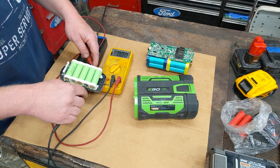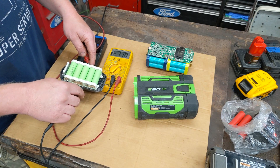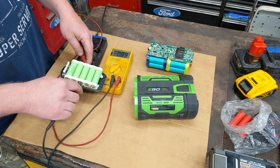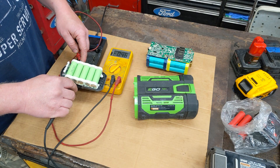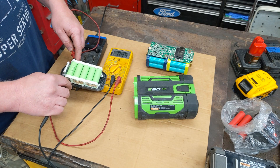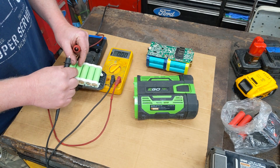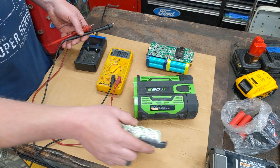The second cell is 1.1 — that will probably come back. About 0.89 volts — about one volt, that one will come back. This one is 0.46 — not gonna come back probably. And 0.46 — these two cells right here are probably my bad cells, and these three are good. So I can get three cells out of this little pack.